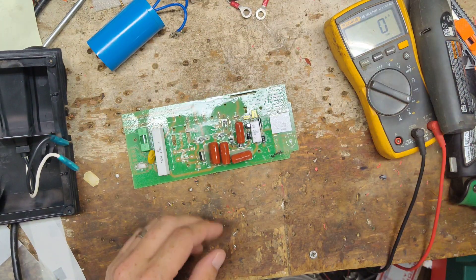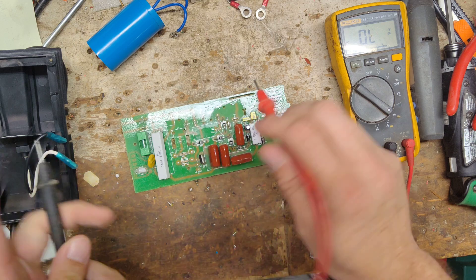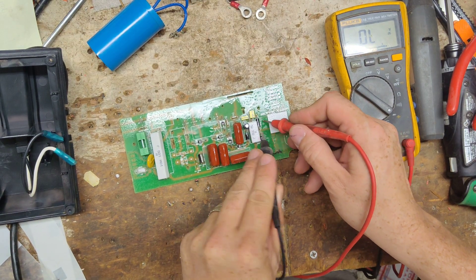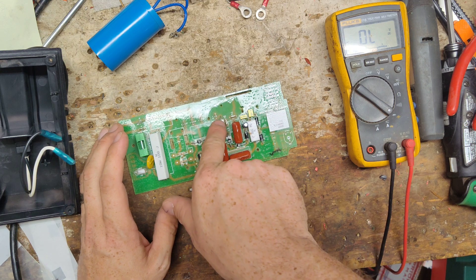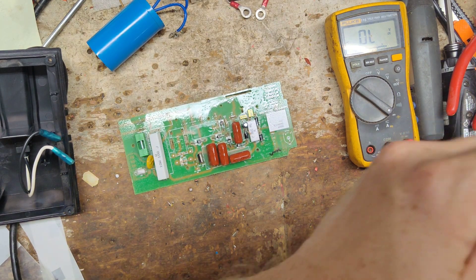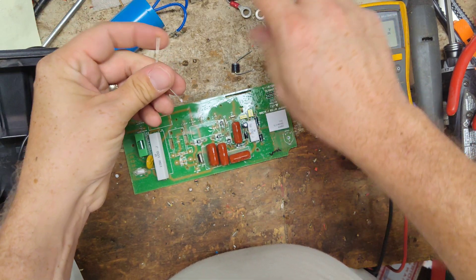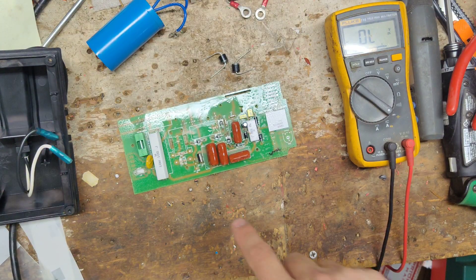We'll check these diodes. These older ones with the white diodes — certain ones were prone to failure over other ones, so we'll check them all out. See, that one's bad. On these old ones, we've got to replace this one and this one — even though this other one is good, we'll go ahead and do that. I think what we're going to do is update this board by putting a second SCR right there. If you look at the old board, it's got two of them on there, so we'll put a second one on here as well.